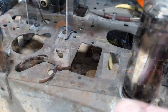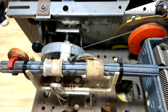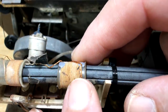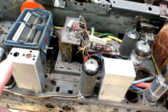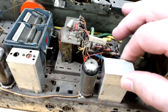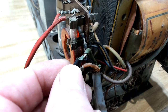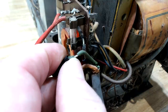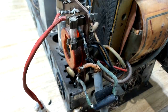Here's the back of the set. As I could see before, the base is pretty rusty. I've put some tie wraps here just to hold things temporarily - when I got the set the wiring was just floating around hanging on very fine wires. There's a bit of damage to the lid's wiring, some there and some up there, so that's going to have to be sorted out. The two IF cans are here, and one side's blank because the FM was never fitted - it's got a little cap on it.